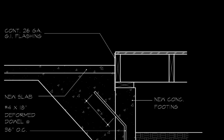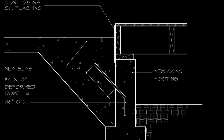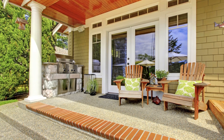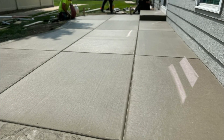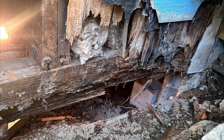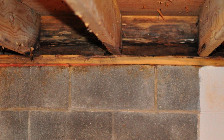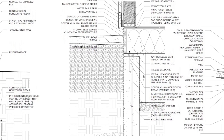One of the biggest reasons why we see floor framing being located partially below grade is usually because the designer or the builder wants to provide a smoother transition between a porch and the main floor, or a flush transition between the indoor and outdoor space, typically accomplished by pouring a porch slab directly against the framed wall and floor. This is exactly where we tend to see a lot of rim joist rot, as well as basement leaks if the porch or patio is poorly drained. This is primarily a design issue, especially if we see this practice in new construction.